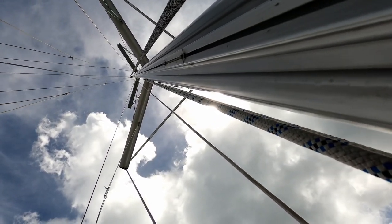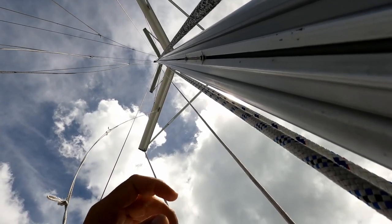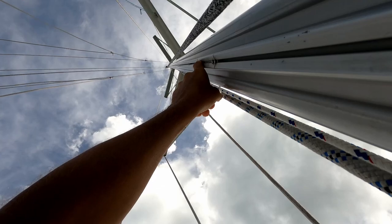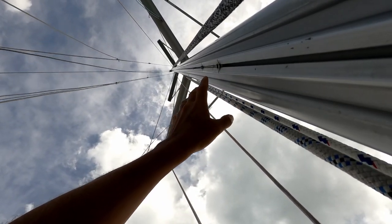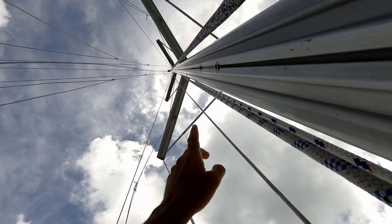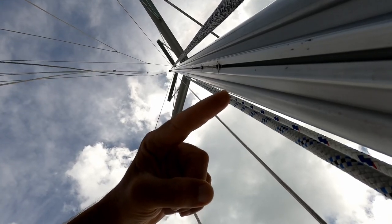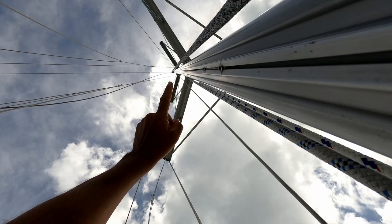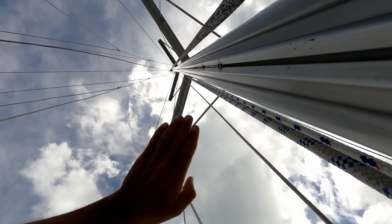We're looking up the mast here and there's a bit of halyard banging and flopping - I'll talk about that in a second. First, you want to be looking up the back end of your rig because this tells you everything. Looking up the track, we can see they've been on one tack coming down the coast. The bottom panel, where the lower spreader is, has a bit of a curve at the top of screen out the starboard side - it bends that way a bit. Between down here and the second spreader there's a curve in the mast.